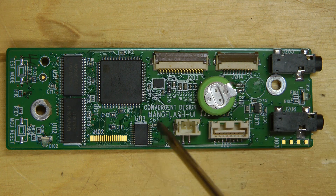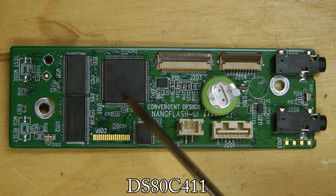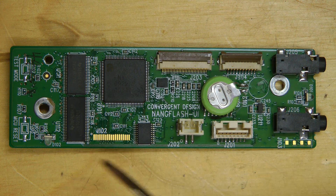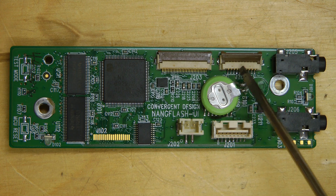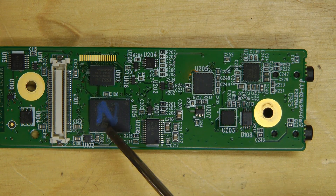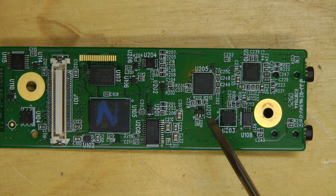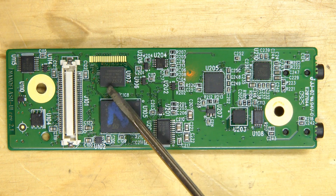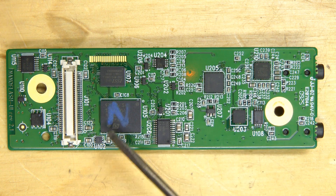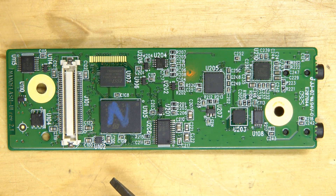This board is labeled the UI board — NanoFlash UI. This has a Dallas 8051-based microcontroller, a couple of level shifters probably because the micro runs at 3.3 volts and the FPGA I/O probably run at 2.5 or something. There's a backup battery for the RTC, a connector that goes to the LCD, one that goes to the auxiliary connector, and audio I/O on the other side. This is a 16MB parallel flash, I believe that's a SRAM — specifically a 512K by 8 SRAM, probably for the CPU — and this is an RS-232 level converter. One thing I'm curious about is why they need so much ROM for the CPU, because there are no images stored in this as far as I know — it's just a basic menu system.